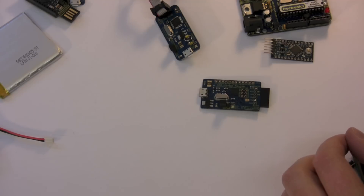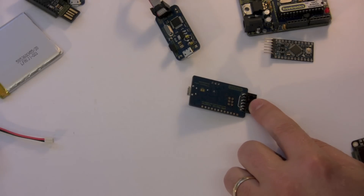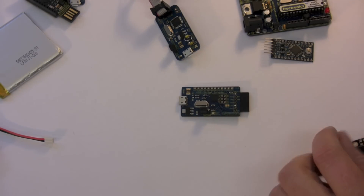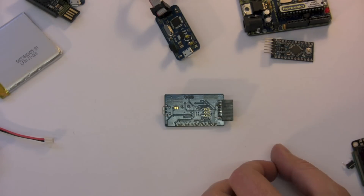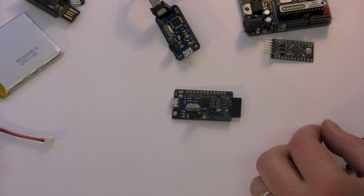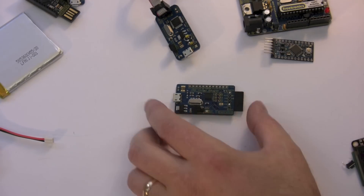Normally for something small like that I wouldn't have bothered to revise the PCB design, but there was another problem. I discovered there was a mix-up on this particular board with CTS, RTS, and DTR — the handshaking flow control used by the Arduino IDE to reset the target in order to load a new sketch onto it. I had to cut and jumper the PCB. Once it got to the point where I had to modify the PCB anyway, I thought I might as well apply some of these other improvements, and I've also increased the size of some of the labels, because I discovered they weren't clear enough once I saw it like this.